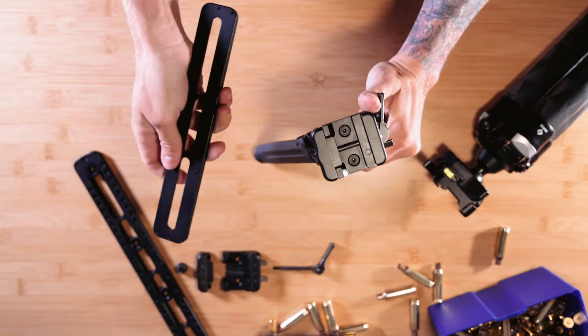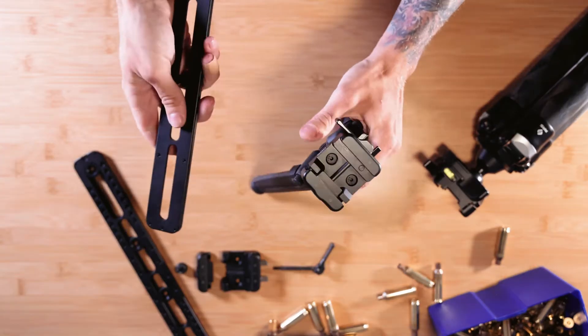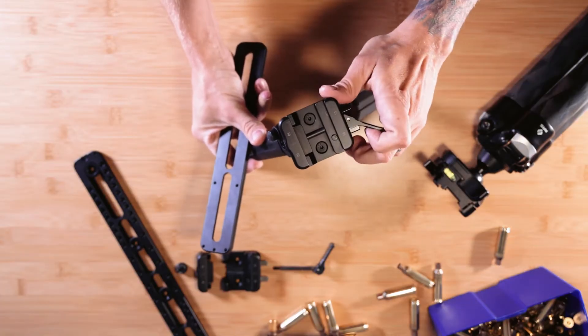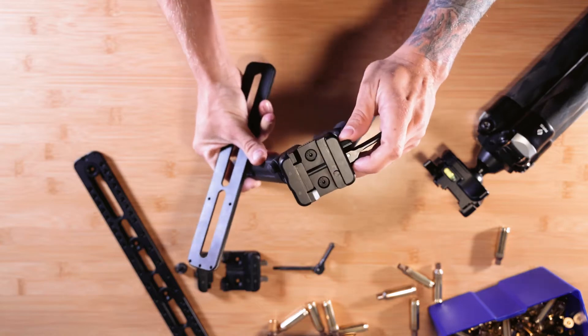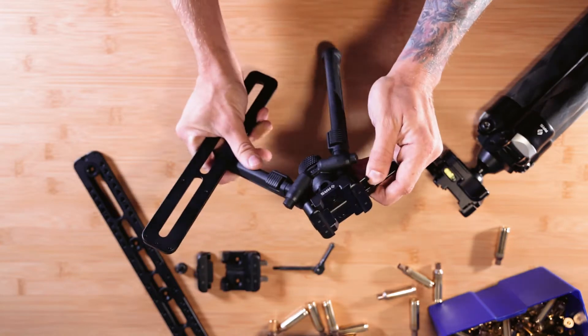When the clamp is open, the pin is automatically depressed. When you go to half or full, the pin is locked in the up position. If you manipulate the butterfly, you can manually lower the pin.